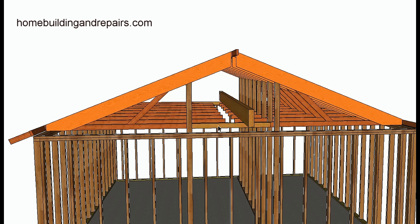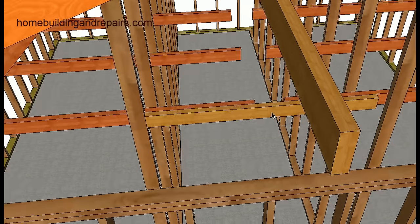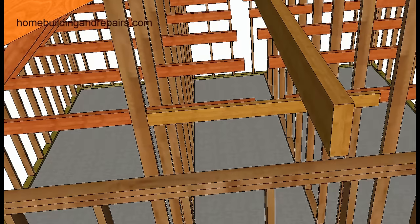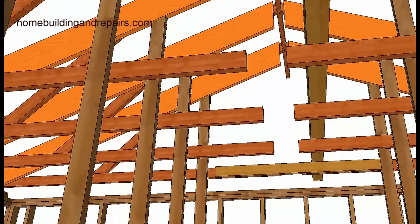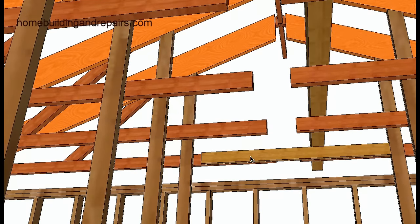The next step would be to install some type of 2x4 — you can use a 2x6 or 2x8, depending on if you need to raise it up. Sometimes you might have a truss clip sticking up, and if you're not going to remove the center, that clip could be in your way, requiring a 2x6 or 2x8 to raise this up a little higher. Either way, you're going to need to put a support board here so that you can actually move the beam into place after you have installed it.